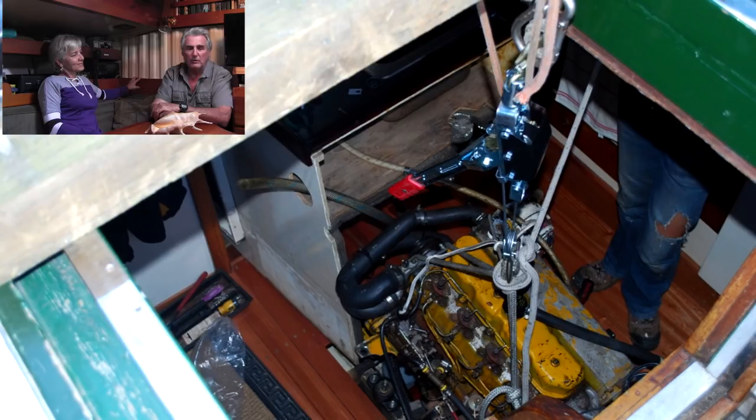Luckily we have a come-along on our boat. By attaching a strong piece of wood over our hatch and suspending the come-along, we attached it to the engine. We removed the 4 nuts from the engine mounts which hold the engine. Your exhaust hose, your water cooling hose, and also your electrical cables and gear cables all have some play, so there will be no problem with them.